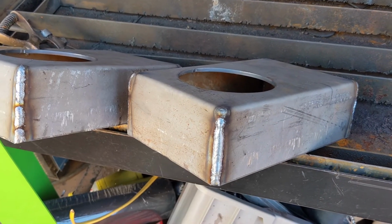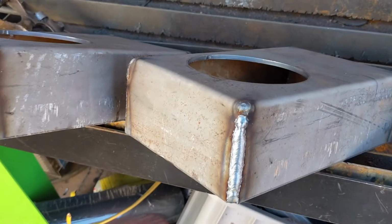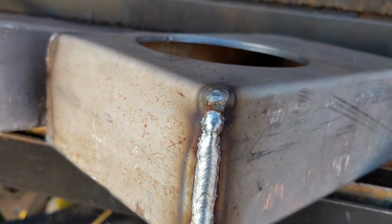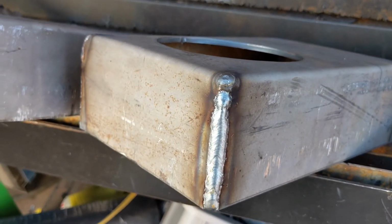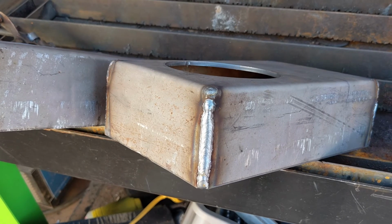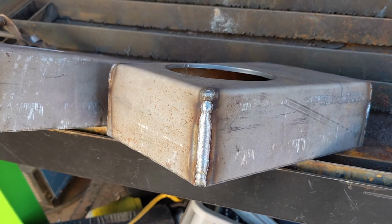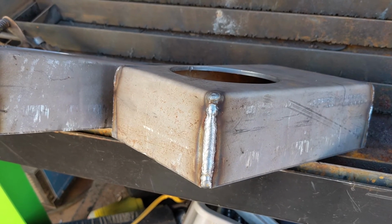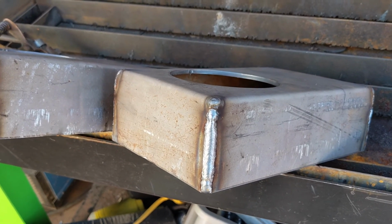And then I welded up the corners, made sure I had a good little bulbous bead there so that that's filled, and I will just grind this all down, give this a little sanding so it's got the same patina, spray it with a little hydrogen peroxide, vinegar, and salt solution, and weld it in place. Actually, I'll weld it on there and then spray it.